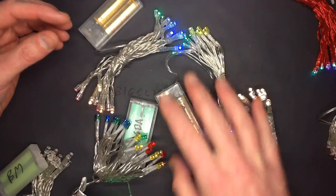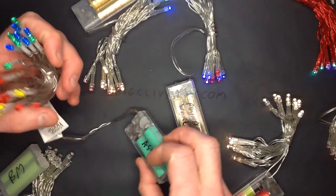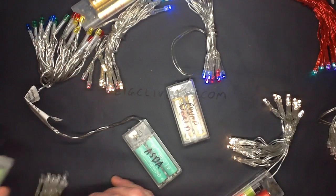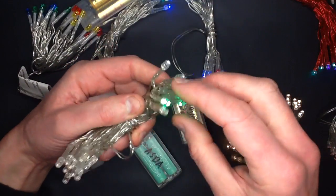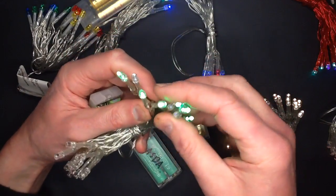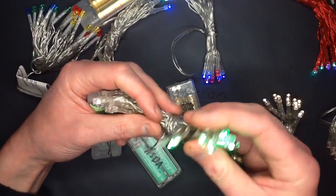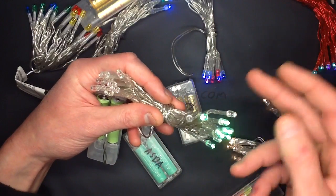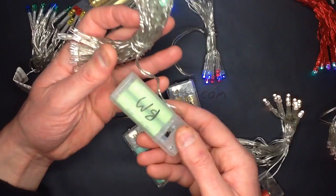A little addition to this video - I've had these lights on test for some time now and I've just been letting them gradually drain the batteries down. Things like the Asda lights started off with nickel metal hydrides that didn't have much charge anyway, so they've gone down quite quickly. But they're all still glowing at a very low level. However, another set I added - the BM Home Stores one - is displaying that trait I mentioned earlier, whereby they've used separate green chips versus the blue chips for blue, and the blue chip with phosphor for red and yellow. Because they've used actual native green chips, they've got a slightly lower forward voltage and they've dragged the voltage on all the other LEDs down. So the only ones lit in this set now are the green ones, because they continued to conduct quite heavily at the lower voltage and pulled the voltage quickly down below the forward voltage required for all the other LEDs. That's a bit of a shame.